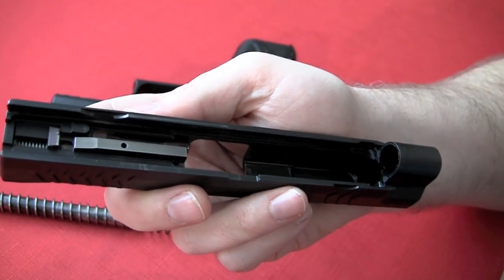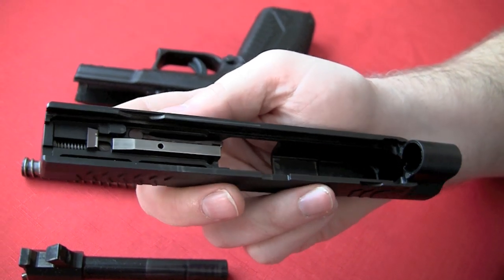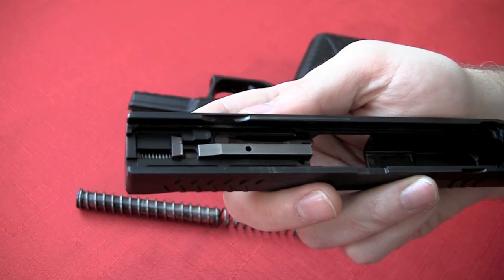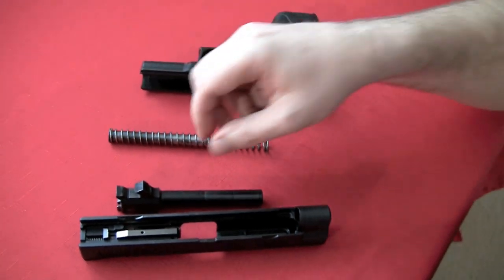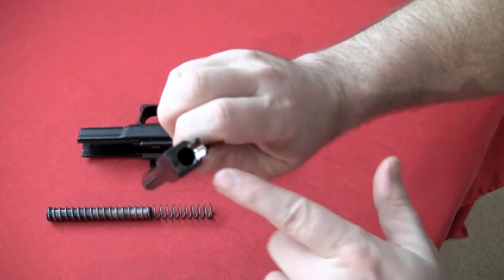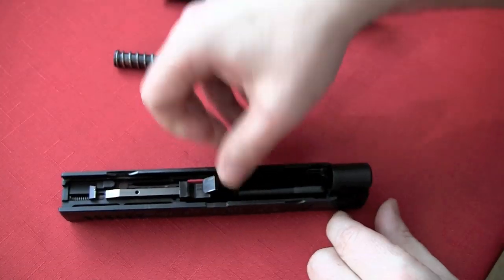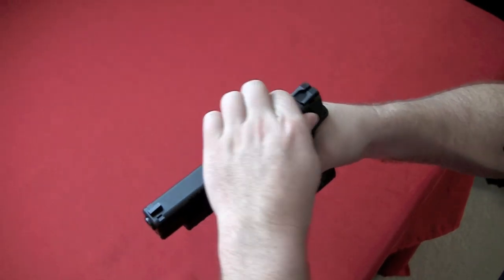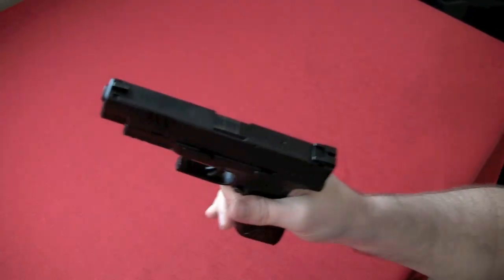The machining is really nice on this particular pistol and I have no gripes with it at all. It has the firing pin safety block as many do — one of the internal safety features. It's a straight-ahead takedown with a nicely polished feed ramp. It goes back together very simply the same way it came apart — drop the barrel in, slide the recoil spring on, slide the slide right on, pull it back, lock it, drop the lever back into place, and you're good to go.